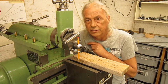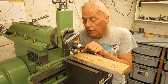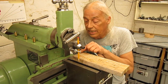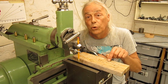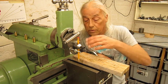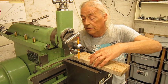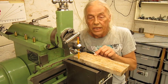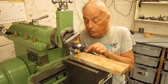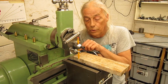Answer: yes and no. If we cut the part lengthwise, the travel will stop right here, which means at the end of the cut the chip will not break. So we always have this curly thing that we leave behind. If we cut in the length and then turn the part to the other side, you will never have a perfect finish, because of the same chip problem — the chip will not break from the other side.